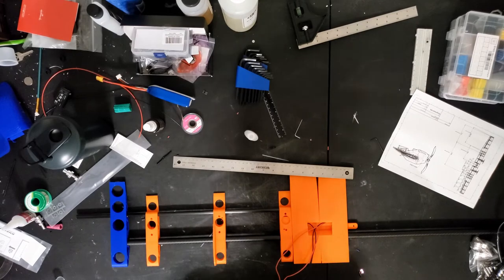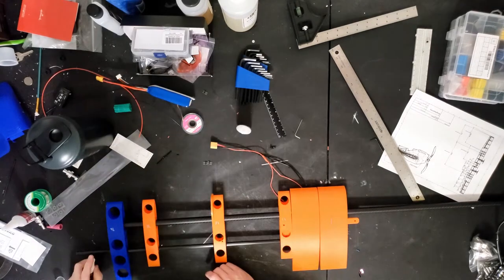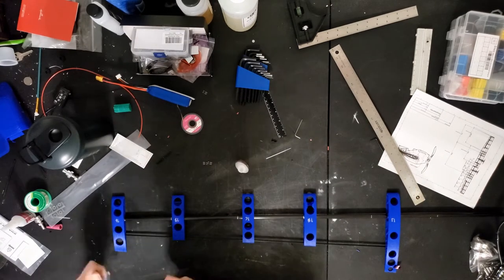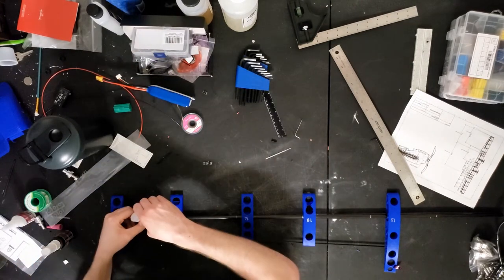Connect it to the spars using some CA glue and some accelerant to cure it faster. The outboard section of the wing uses one main circular spar and then a 6x1mm square spar that goes the length of the front of the aileron.